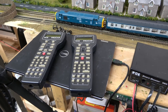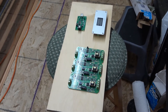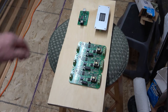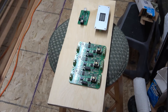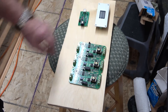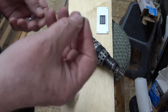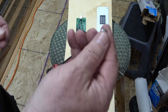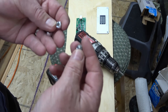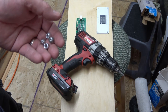As I'm starting to add more components, I decided I need to get myself a board and install these on the board. I'm just going to lay them out. I'm going to use some spacers because these circuit boards need to sit up a little bit so that the stuff on the back isn't on the board. I'll use these little nylon-centered nuts — they're just enough to keep the things off and they'll work the right size. I have a whole box full of these things, so I'm just going to use some of them to lift stuff off the board.